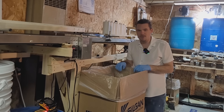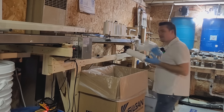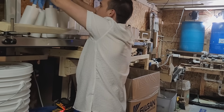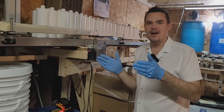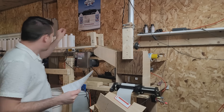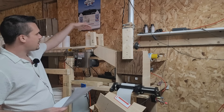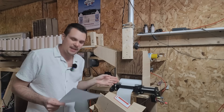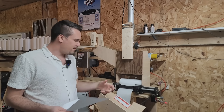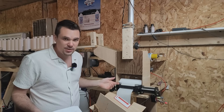A lot of people have asked why we label the bottles first. With the bottles being empty they're lighter and easier to manipulate, and the way the labeler setup is configured, it just works better. The next question from the comments: why do we label the bottle on its side? This labeler was originally a semi-automatic labeler that I converted into a full auto with Arduino. The empty bottles are very lightweight, so when they tip over hitting here they fall down and land horizontally. This labeler is originally intended for horizontal labeling, so instead of further modifying it for vertical orientation, it was easier to just have the bottle fall down the way it was originally intended.